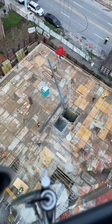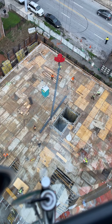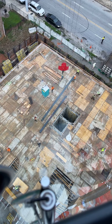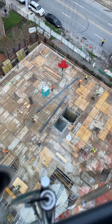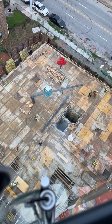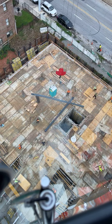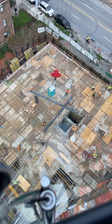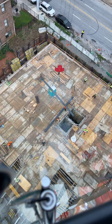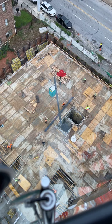When I do these heavy loads like this and they're real long and oblong, I just take it super easy, because there's no sense in getting in a big rush. When you have a piece this big, your pendulum swing, if it gets out of whack, good luck trying to slow that down because it's a disaster trying to. Cable down, Jason, 7 feet. Cable down, 3 feet. See, he's already swung this once, so now it wants to swing in circles. Cable down, 3 feet more, Jason.